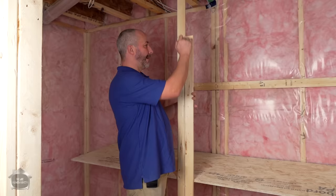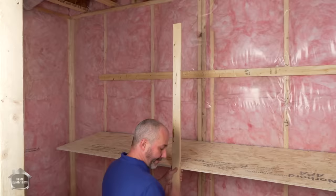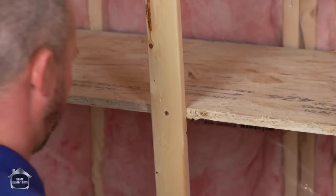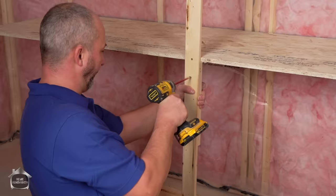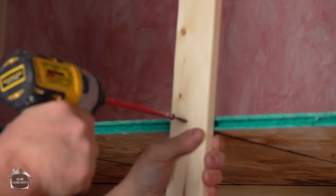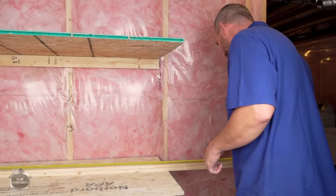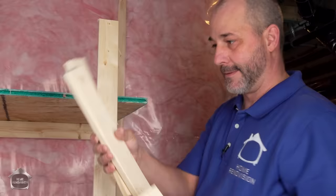The reason for that is it makes a great place to drape extension cords, Christmas tree lights, that sort of thing. We'll just lift this up to flush now. So that we're not relying on the strength of that screw in the aspenite, we're going to drive a couple more screws into a block just underneath the backside.